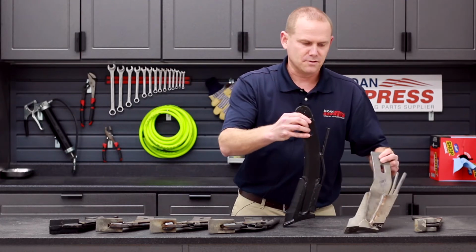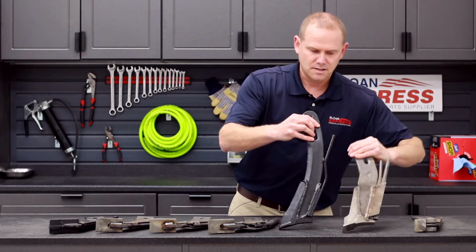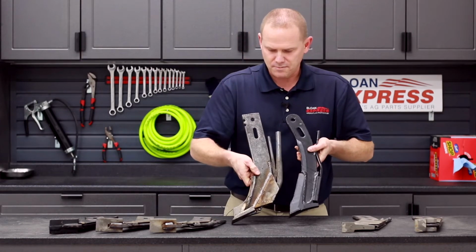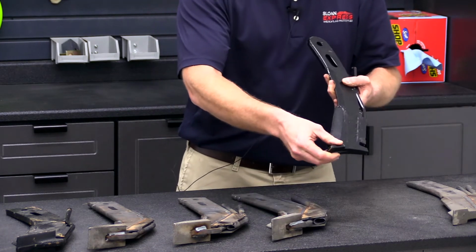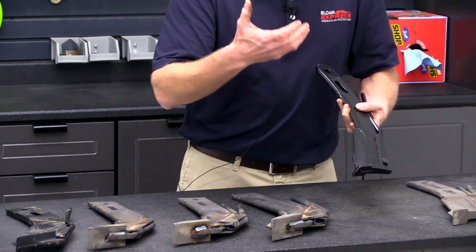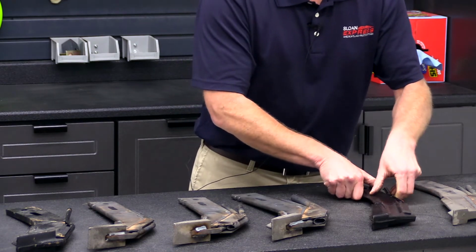So again, we've got another of the Weiss knives, and then we've got Hypro's mini mole. What you can see, the main difference between your mole knife and the mini moles, you can kind of see there's a different cleat there, a different source of lifting action in the soil. A lot more narrow, so it isn't going to pull that soil up as much, but it's still going to allow that anhydrous to seep into the ground and secure itself in.